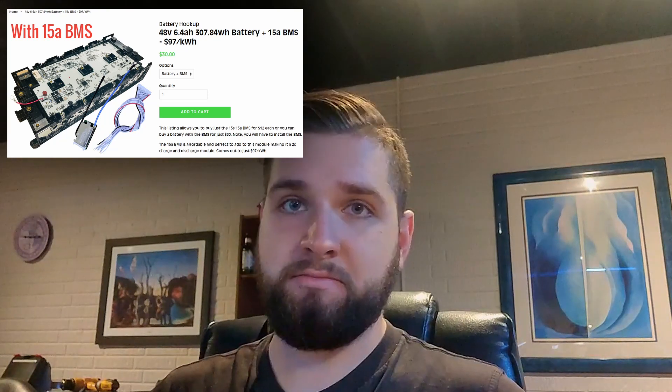No doubt many of you are asking: how long will it last? That depends on your pump and your water usage, but in our standard house of four, I determined the pump uses right around half a kilowatt hour per 24 hours — quite a bit less than I anticipated. The battery, composed of six packs, has a capacity of 1.8 kilowatt hours, which means factoring in inefficiencies, the system can run the pump for two to three days with normal usage — showers, dishes, clothes, etc. In an emergency, if you seriously ration your water usage and only turn on the inverter when you need it, you could make this system last up to a week. With these battery packs, you can fine tune how long you'll have access to fresh water — just add another pack.